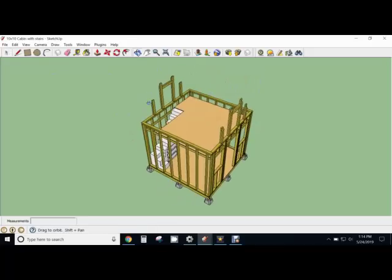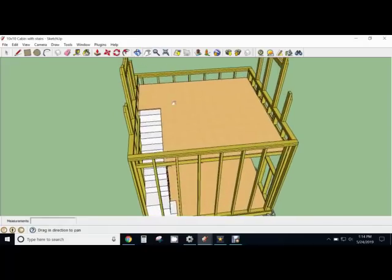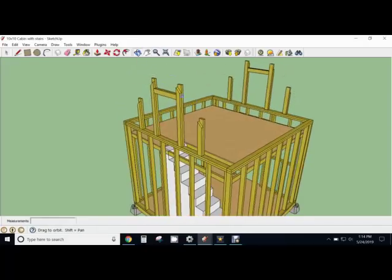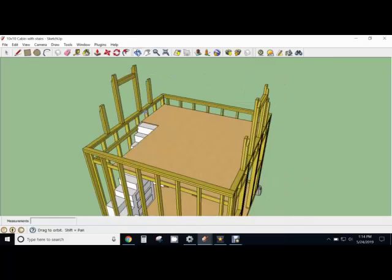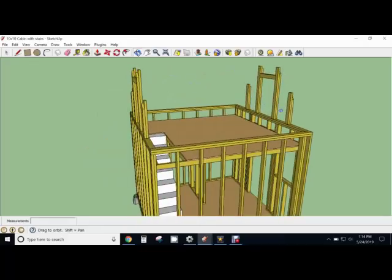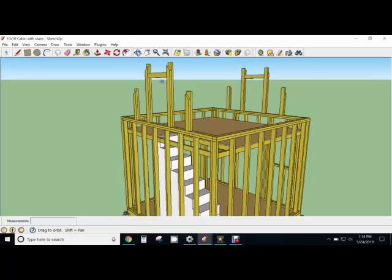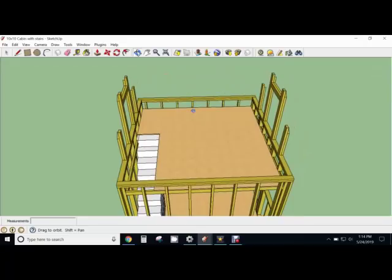And here you can see what I did is I doubled up the 2x4s on the end walls. That gives you a nice plate to attach your inside walling, your inside sheet to on the inside here. And then I show this with 2x3 windows in the loft. And I've got the loft floor set at 7 feet, so that drops it down a foot.